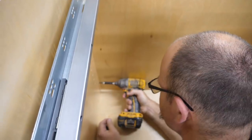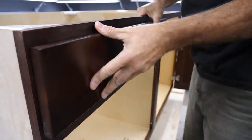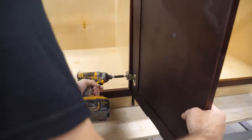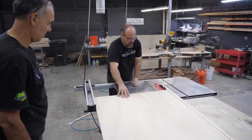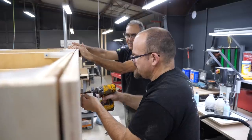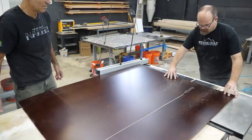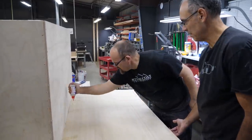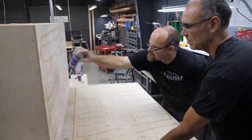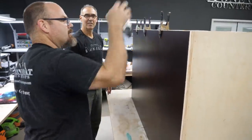After we're done assembling the cabinets, we're going to attach the doors and drawers right back on so we don't misplace anything. Then we're going to add some plywood to the back of this island. The back of these cabinets are one-eighth inch veneer, so we want to beef it up because this is going to act as an island and be finished on all three sides. After we attach that three-eighths inch plywood, we're going to cut our veneer to finish this off like a pro. We're going to use our 2P10 glue, which is super glue, and our accelerator. First, dry fit everything — make sure you know exactly how it's going to fit. We'll add our glue on, spray the other part of the substrate with our accelerator, rub that for about 15 seconds, and it'll be solid as a rock.